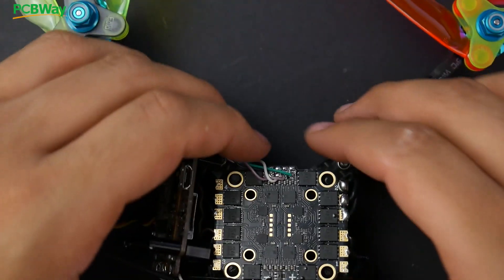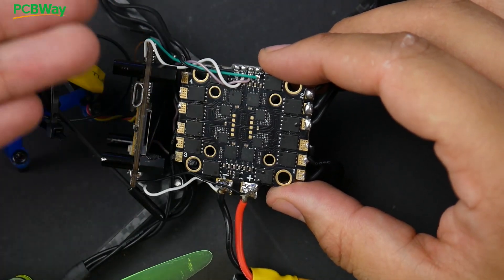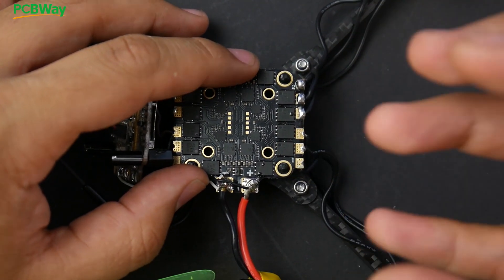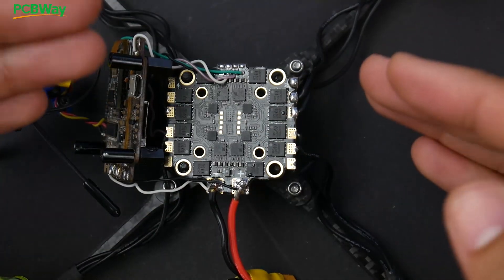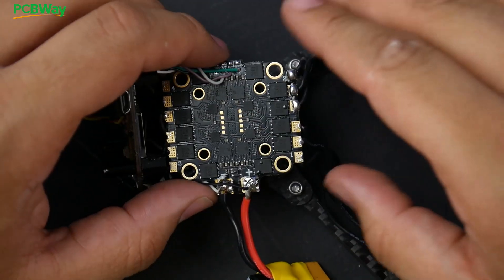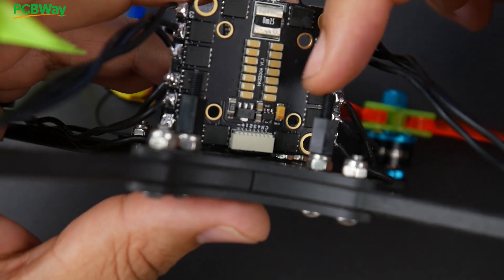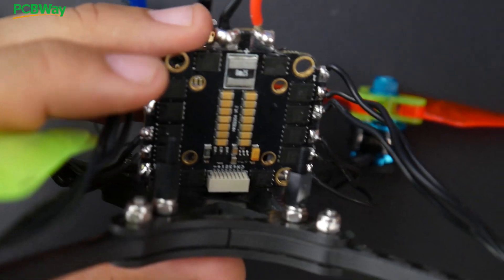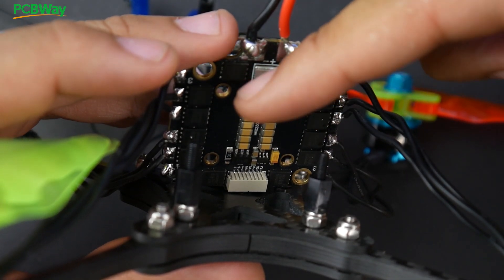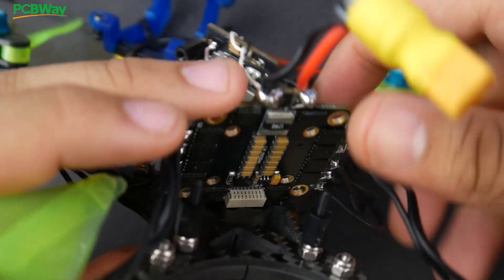There are a couple of things I really like about this ESC. They have the pads broken out right here, which was very useful in this type of build. I truly believe this is meant for a high-load micro-ish build — it would be a great recommended ESC for a 5-inch using a 20x20 flight controller. Looking at the back side, there's no filtration there, but flipping it over, we can see this is the only filtration on board. They could have utilized more of that area for additional filtration, but they didn't — I wish they did. They provide a connector, and I really love the dual 20x20 and 30x30 compatibility, though it does reduce real estate for capacitors.